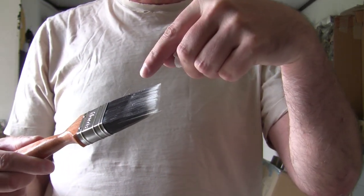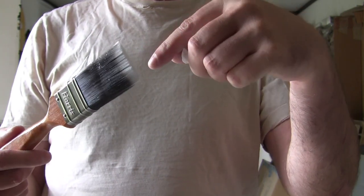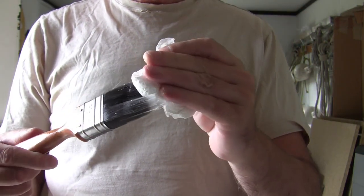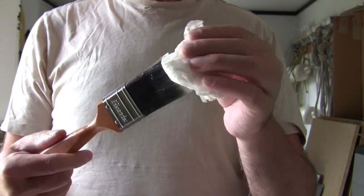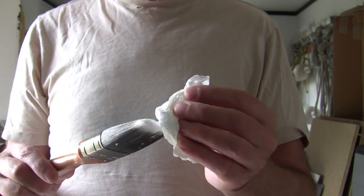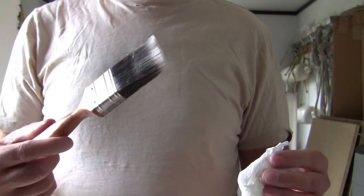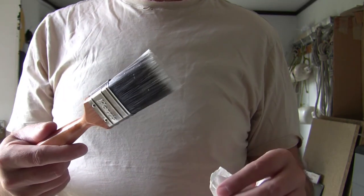There were little tiny speck dust type lumps of cured varnish which came out like little bits of plastic, and although I cleaned the brush as thoroughly as I do with normal varnish, and I did it in the right thinners, which is number 9 in this case, I think I was actually putting little dusty plasticky specks on it.